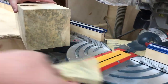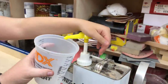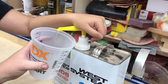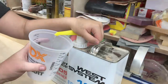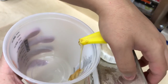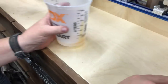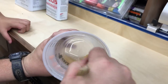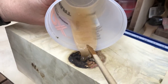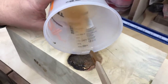It looks like there's a little bit of spalting in this log and it has kind of a unique looking grain structure. You probably noticed the giant knot in the log when I was cutting it out. I really couldn't avoid that, so I figured I'll just mix up some epoxy and fill it with that. I use West Systems two-part epoxy. Epoxy is fairly expensive, but if you buy it in large quantity it's not too bad. I'll put a link in the description in case anybody's interested.